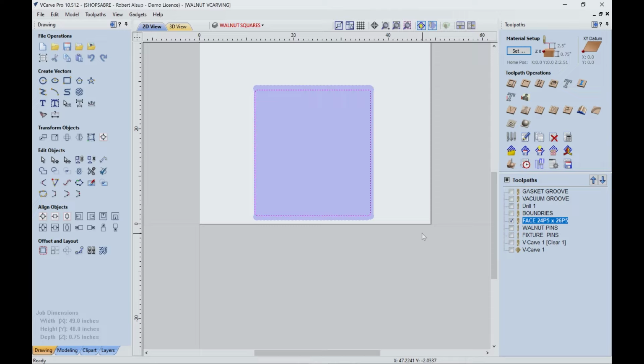All right, now, so let's assume that we've ran it, we've flattened it. We've done that multiple times until there are no defects. Then we flip it over and we do the same thing. And now we want to arrive at a thickness. And typically this board was going to be 1-inch thick finish. So when I finished the surface on the other side, the thickness is about 1/32 over. So I've got a little bit of room to level things out because my target is to finish that out at 1-inch.